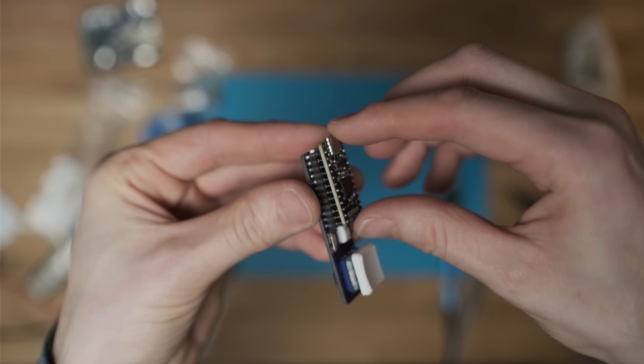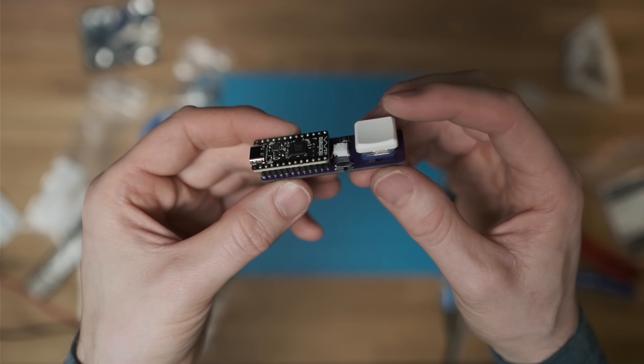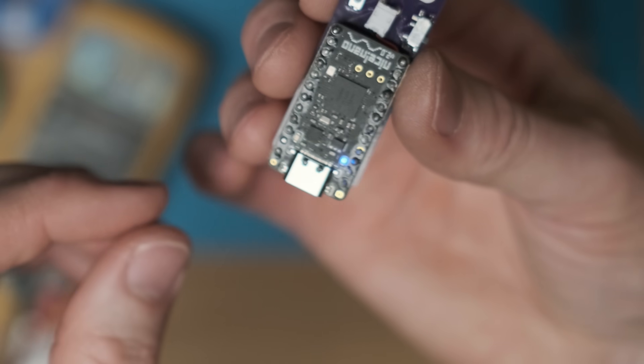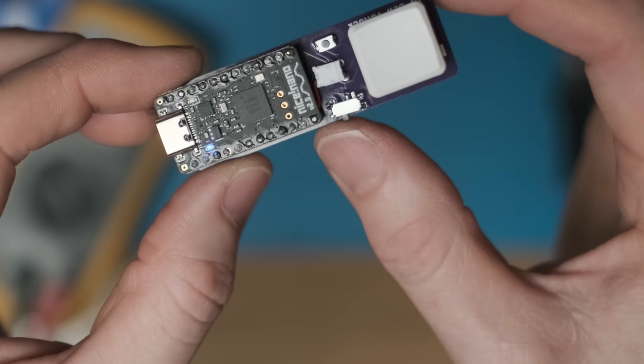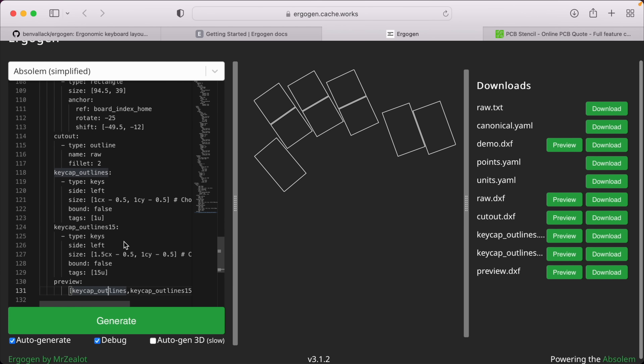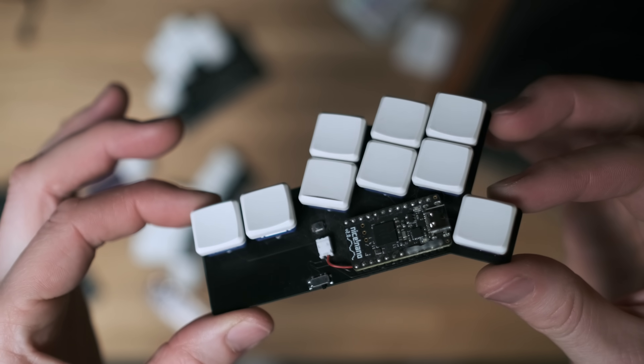Make sure that all works, then add the controller to the socket over the top of the battery — and we're done. Turn it on with the slider switch and we'll see the blue light on the controller come on. It goes straight into bootloader mode because this is the first time we've turned this Nice Nano on, so the blue light flashes ready for that first flash of firmware. Hopefully that's been a useful look at how to build one of these keyboards. You can download my fork of Ergogen, start building keyboards, move into KiCad, upload to PCBWay and have boards built and sent to you. Do check out the other video on the full walkthrough so you can tailor this process to build your own custom keyboard. Please like, share, comment and subscribe — I'd love to hear your thoughts on this build process and any soldering tips in the comments below.